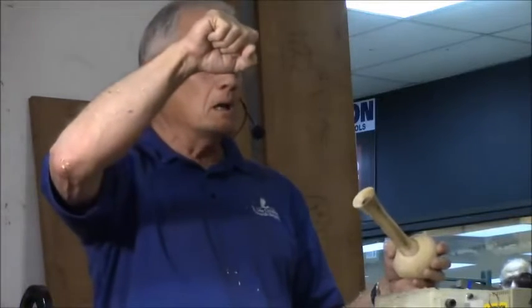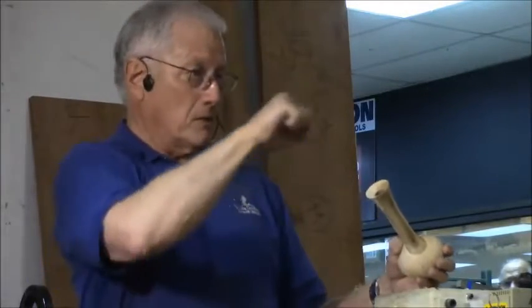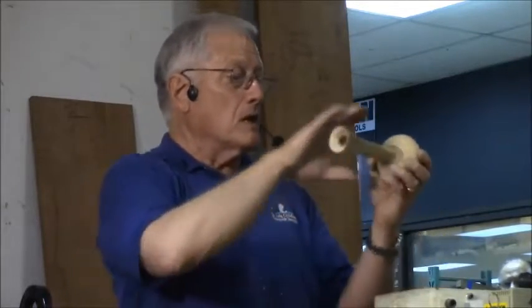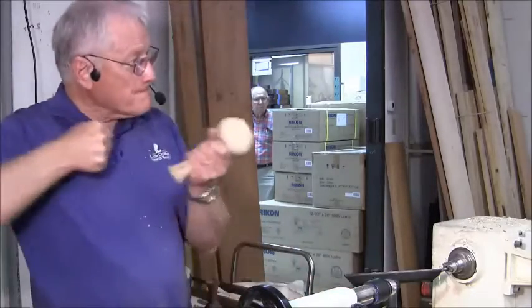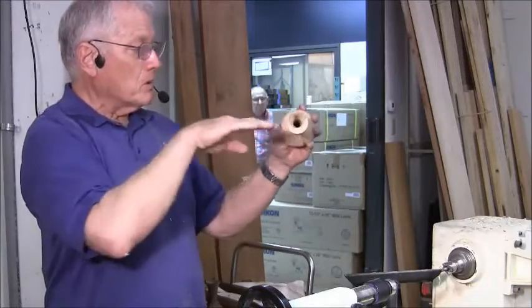And so these gun drills, you can buy them for $5. And so you figure out a way to get it on compressed air with a ball valve and with a handle on it, because you need to be able to hold on to the silly thing. And with it in a chuck on a lathe, what I'll do is I have a small one, and I'll start, and I'll go right through the tailstock. I'll take this off, so I have a clear hole, and I'll go in 5, 6, 7, 8 inches, with the air blowing the stuff out.